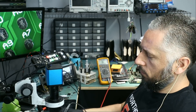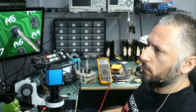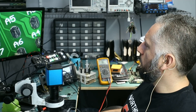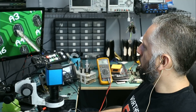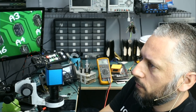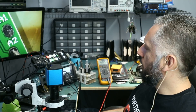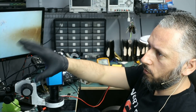These numbers should be more accurate when testing a fully functional console. A5 is reading 0.736, I had 0.739 — which is close. A6 is 0.775. A3, no reading — that's good. A4 is reading 0.465 instead of the 0.519 I had before. Then A1 and A2 are both ground. So I'm going to give the board to Big Boss to reassemble and test. If the board tests good, then we're going to go by the numbers I have written here, and I will share those numbers with everyone.